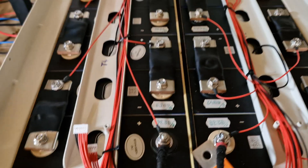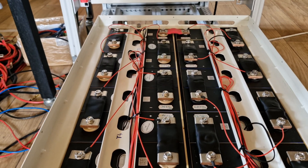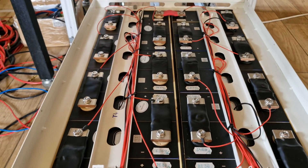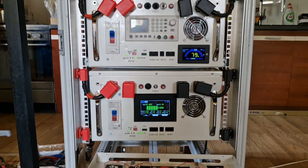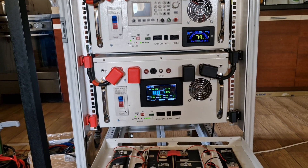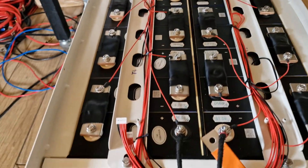And if you divide it by 16, we will get about 0.26 milli-ohm per cell. I think it is a very good result and it will be one of the best boxes I have here at the moment in terms of internal resistance, because in the other two I have actually about 40 square millimeters average and here it is 80.